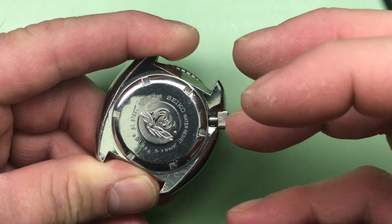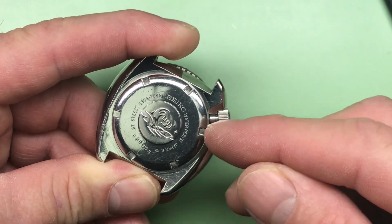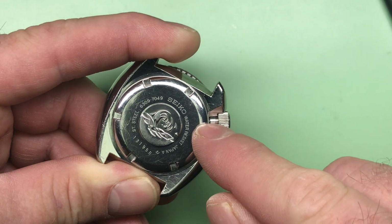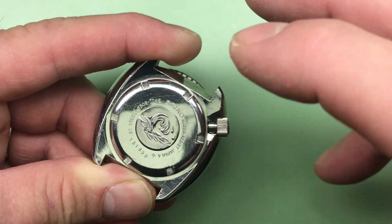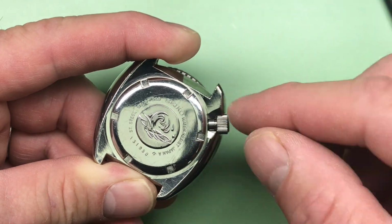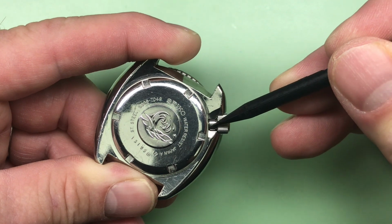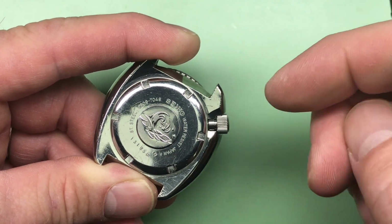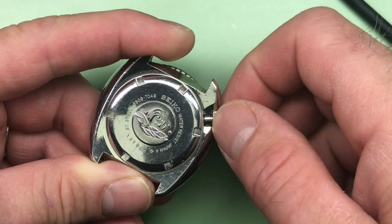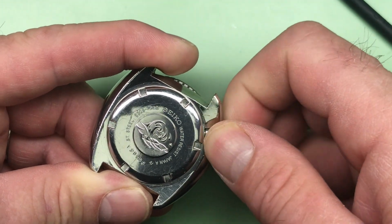However, your crown is made up of two, maybe more components. There's a washer in there and some other things, but the crown itself, where the threads are, is sort of a press fit object. So there's a sort of stamped object around on the outside, which is part of this knurled and this part right here. But then within that is the threaded bit. And so those two things were sort of turning relative to one another when you tighten things down too tight. So first of all, don't go so tight, just to the point where it touches.